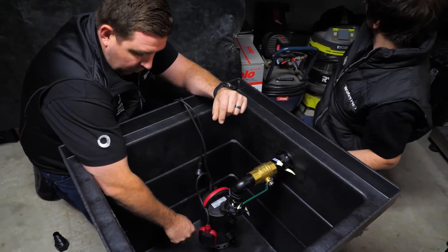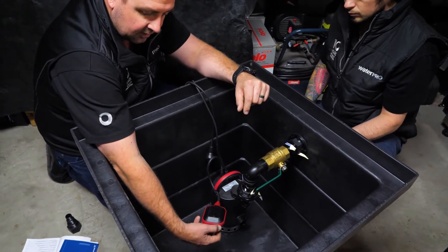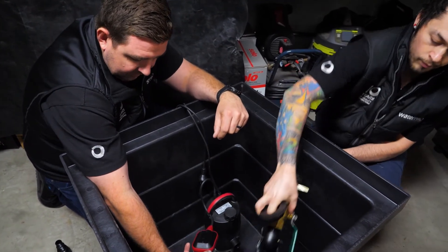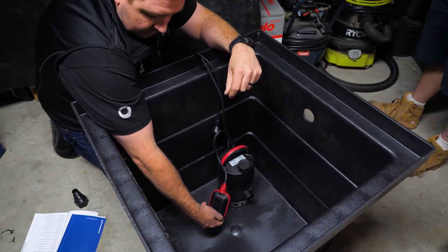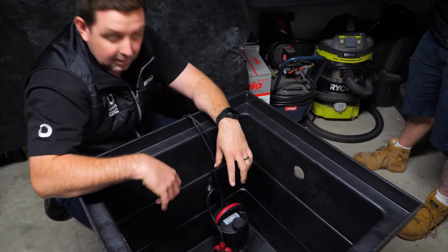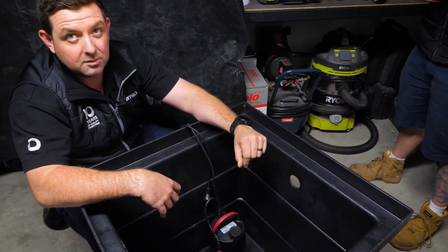The way this pump works is water fills up the sump and the float lifts up — that click you hear is the pump engaging. It's got a bowl inside that. The water will let the pump run until it clicks off. When the float is floating in water, there's probably 80 to 100mm of water still covering the pump. That's important because if the pump runs dry, it can be hard for it to reprime itself.